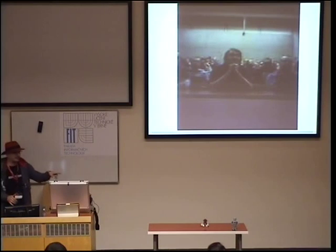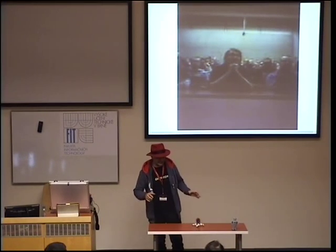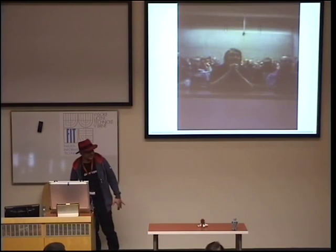Oh, right. The board is too small to run Python. Python actually doesn't fit in memory there. But it's not too small to run MicroPython. So there is a MicroPython version for Linux. They mostly did it for testing. But I use it to run the code here. Yeah, and as you can see, sometimes it works, and sometimes it gets a little bit nervous, I suppose. So some work is needed on that. That's work in progress.